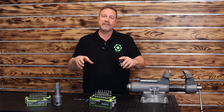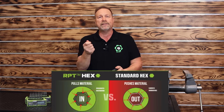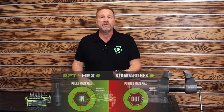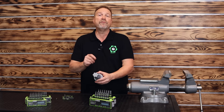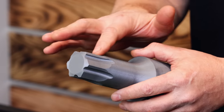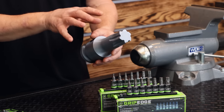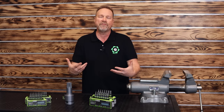The whole technology is designed around pulling the pressure inward rather than pushing to the outside corners. When you put a hex head tool into a fastener and apply torque, all that torque gets pushed to the corners — basically you stretch the inside of the fastener and it allows that tool to round over. A lot of people have looked at this design and confused it for a Torx bit. It's the only hex head on the planet that has these U-shaped cavities machined into it. There's some very interesting machining work going on that allows our design to work. These are for Allen or hex head fasteners only.